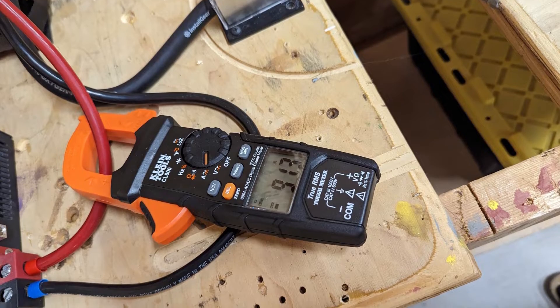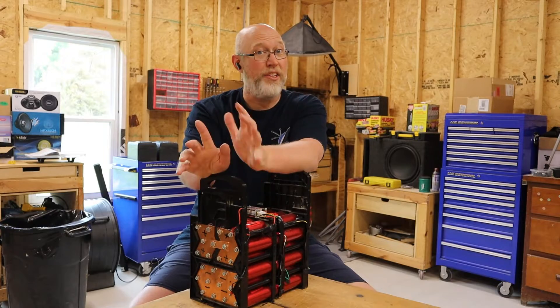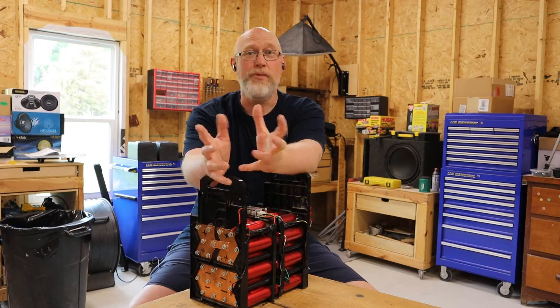It works fine for a day or two, and then the power supply went into protect every time I plugged it in. So I'm going to try to harvest the cells and build a smaller battery. That's an easy problem to fix — all you've got to do is take it apart. And when you do that, this is the cheapest way to buy Headway lithium cells.